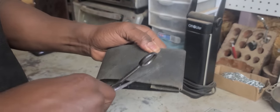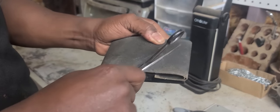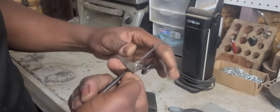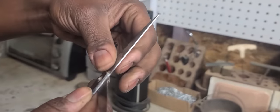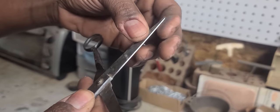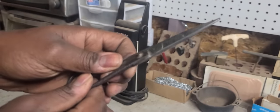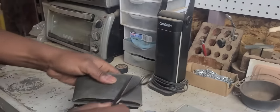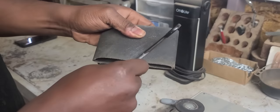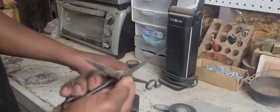As you do it, each time you do it, you'll start to feel the angle, and you can just play with that angle, and you can feel your body lock right into the angle. Okay. Now you see what we're working with? There's a slight, you see that metal? There's a slight burr that's on the back of that shear. And when you hear that, that's that roughness, you cutting that burr that you created. And you keep going until you realize what you created is the smooth, sharpened edge. Then of course you flip over and you start all over again.